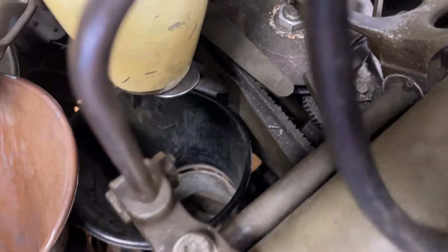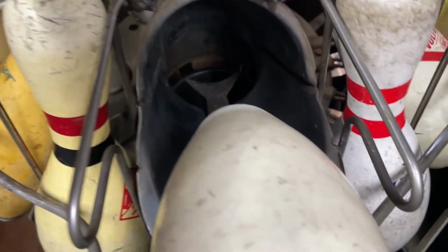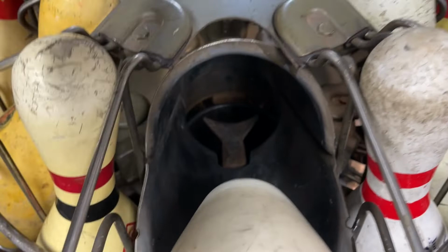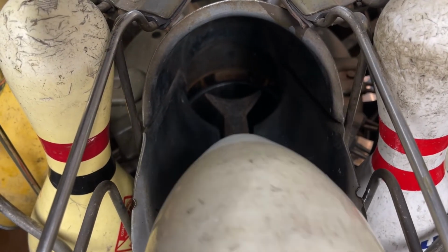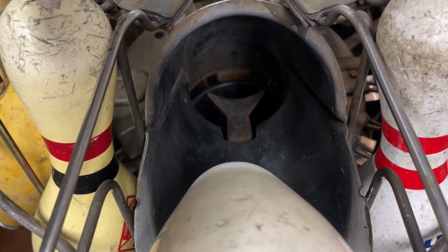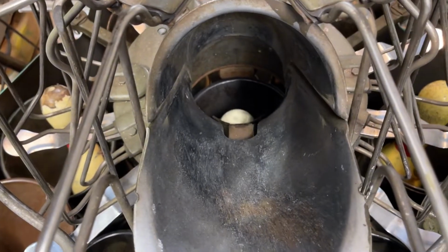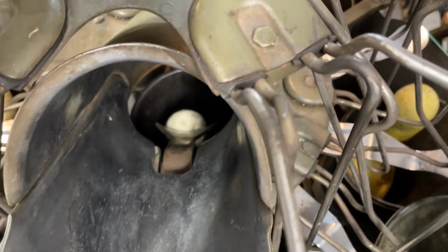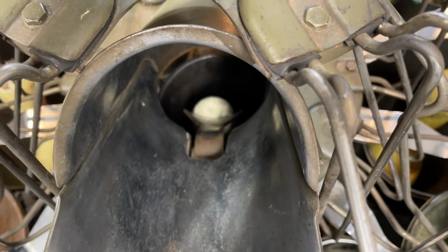to your interlock probe, which is hard to see, but it's under the trip lever right now. It's the one that hits that blocking finger. But if that tongue is pressed, it's going to keep the spider from locking. So when this 5 pin goes through, it's going to push the tongue. It's spring loaded right now. Spider's going to open. And what Rip noticed is that 5 pin, if your turret's not level, that pin can